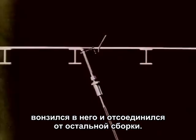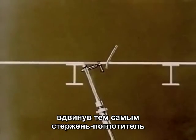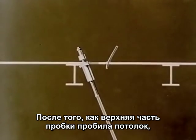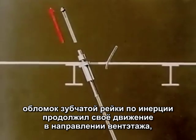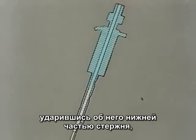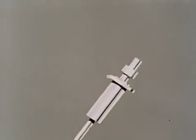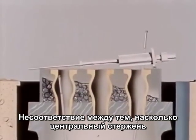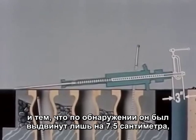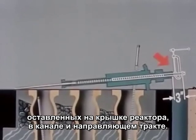The handling tool impaled itself into the ceiling. The impact also broke the rack inside the plug and simultaneously caused the plug to slip back up the rod to the fully inserted position. The plug flange then hit the overhead structure and the fractured rack continued into the fan room. The plug fell back onto the vessel head, snapping the connecting rod after it had been driven upward through the plug about three inches. The scratch mark evidence and matching marks on the tube and extension explain the seeming discrepancy of finding the central shield plug with the final rod withdrawal position only three inches above the normal zero position.